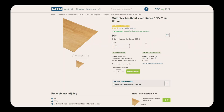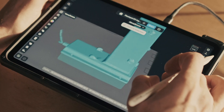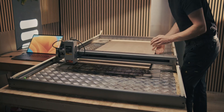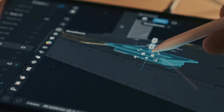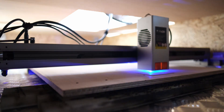The size of the setup is based around utilizing material as effectively as possible. You can buy sheets of 60 by 120 centimeters pre-cut in stores here in the Netherlands, so I'm utilizing the maximum amount of that. I'm drawing it out in CAD because I have a large laser cutter which cuts it out really accurately and cuts all the holes in the bottom for the interfacing gear. If you don't have a laser cutter, a jigsaw works absolutely fine.